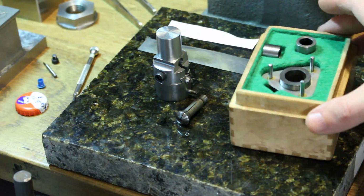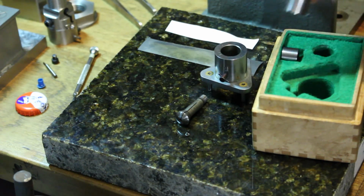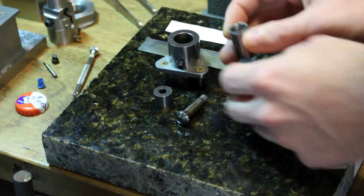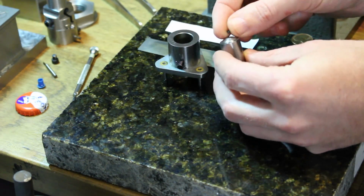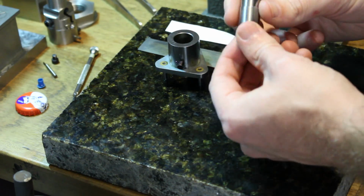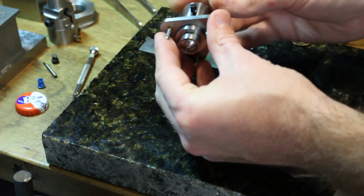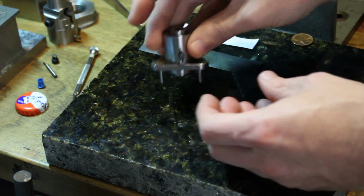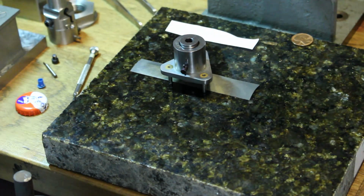It was made from O1 drill rod so that it could be hardened and tempered. And it was during the tempering process that something went pretty wrong. Before we get to that, I'll take you through the process after hardening, but before the screw was polished. What you see here is my homemade screwhead polishing tool. It takes the same Webster Whitcomb collets that my watchmaker's lathe does.